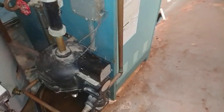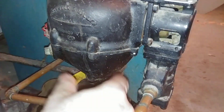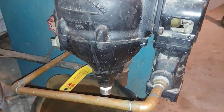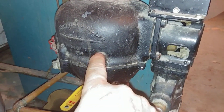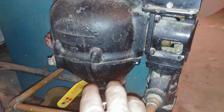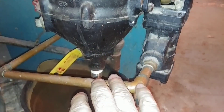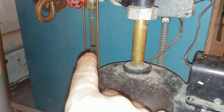The reason why you blow it down is this is iron body, and it's designed to concentrate any sludge that forms in there, because there's a float inside. If there's too much rust, the float will hang up and not drop on a drop in water level.